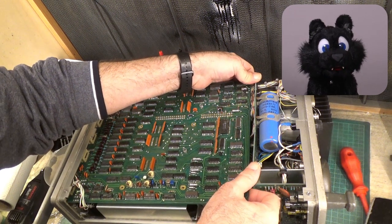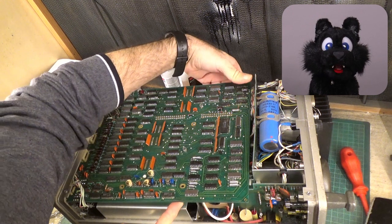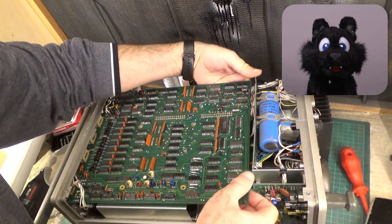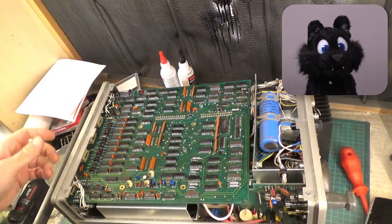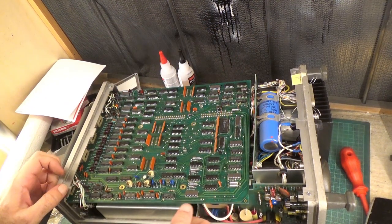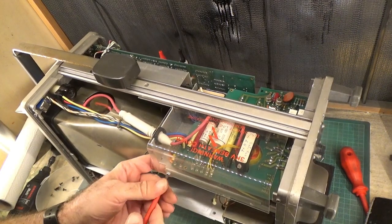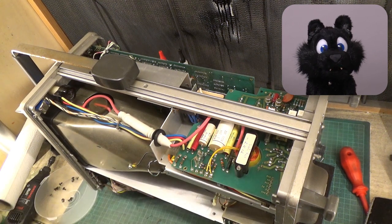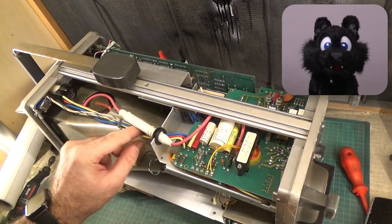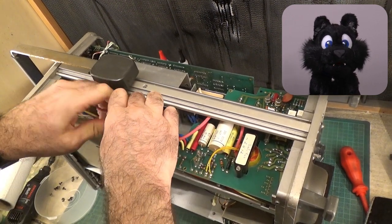Taking the main logic board out is a bit of a chore already. It is wedged in there between the front panel and an ISA-style port connector. Better not use too much force. The high voltage power supply sports a nice warning, and while the anode is plugged in, all the other lines are soldered in place. Why?